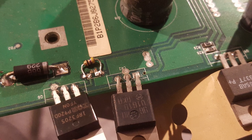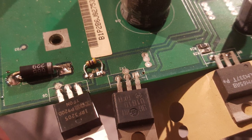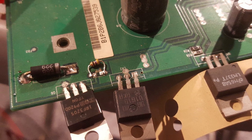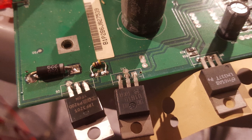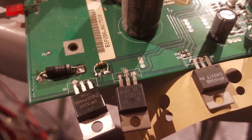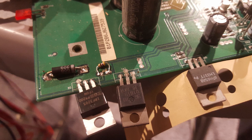Here you can see I used a regular resistor and new diodes. I was a little bit confused because the power supply of the amplifier was damaged and nothing more was damaged — no driver transistors, no output field effect transistors, nothing. Usually if the power supply is damaged, some outputs or drivers are damaged too, but not in this case.